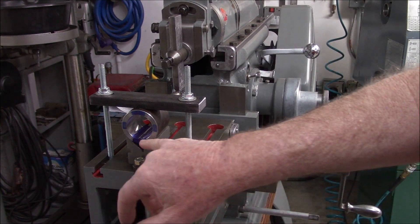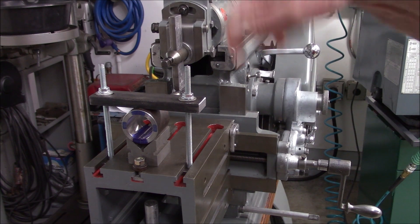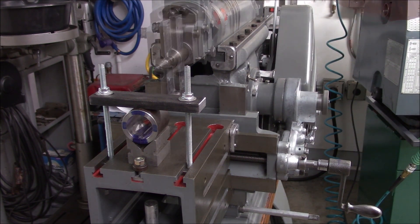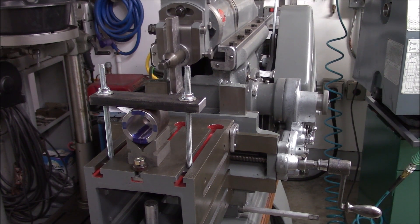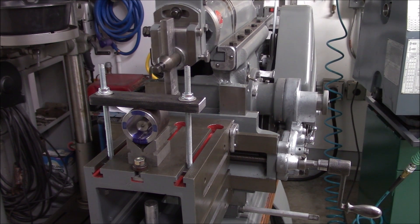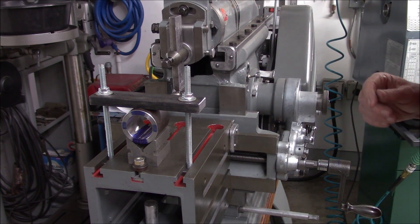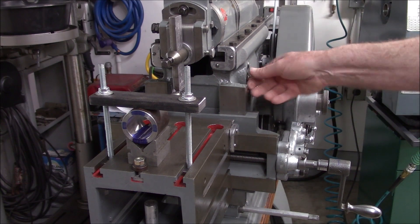So before I start, as soon as I get a flat all the way across, I'm going to set my zero on the down feed - we've got a down feed of 125 thousandths. Here we go. I'm not sure what I was hearing, but I've locked the clapper box. We still got to get through some of these burrs and stuff from the carnage we had on the last attempt, so let's try it again.